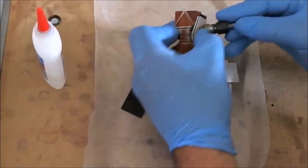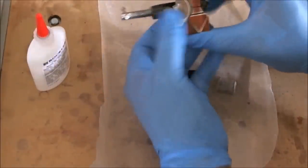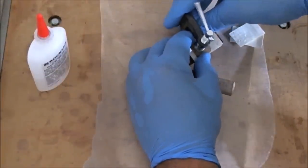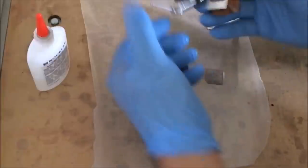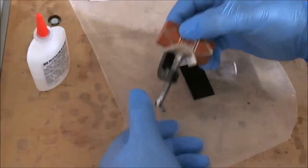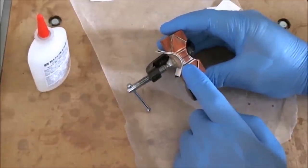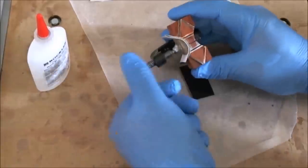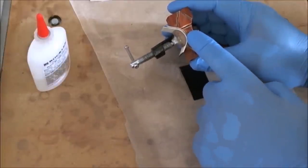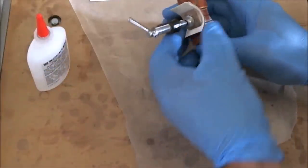One inch C clamp. Okay, so now we can go ahead and start to tighten that down. And the good thing about 3 layers of veneers is it's about the same thickness, a little bit less once you get down to its final tightness, as the thickness of the saw blade itself, so it's going to follow the same diameter inside and out.